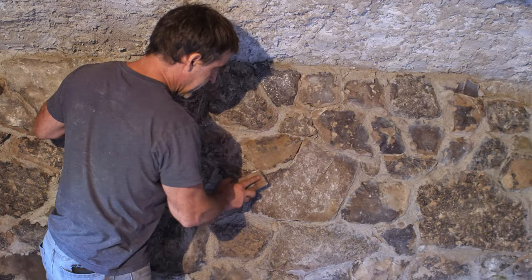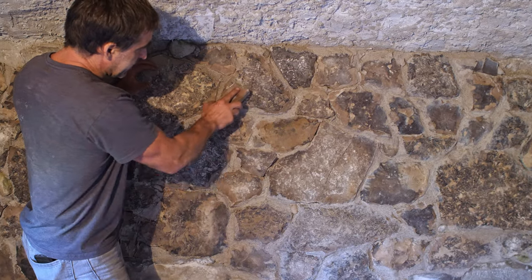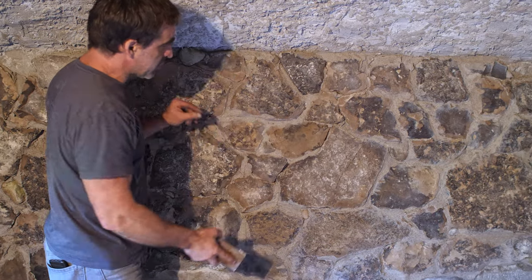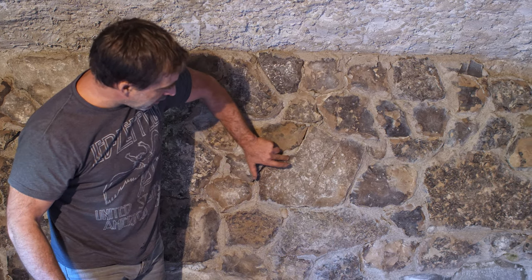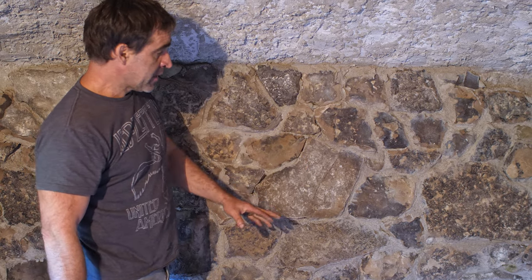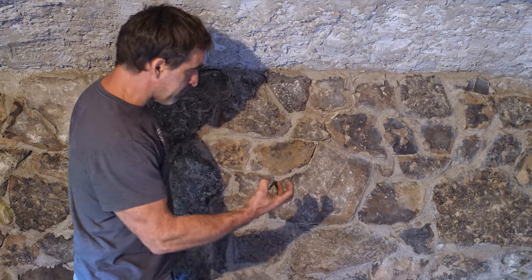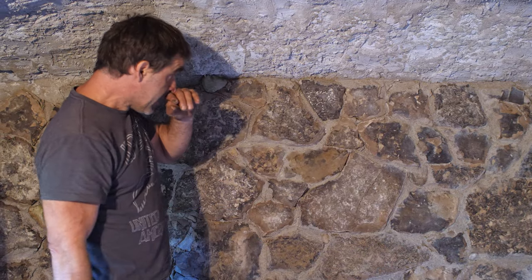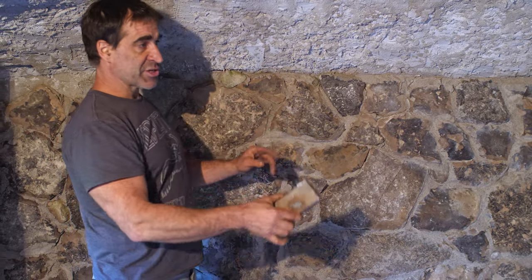This time my schedule dictated we're doing it the next day, so just brushing out the joints until I'm pleased with the result. There's going to be some residual mortar staining on there that I'll have to clean up. I can sometimes do it when it's fresh with just a wet rag. I can also use muriatic acid, or I can use a wire cup wheel on a grinder and pull that out.